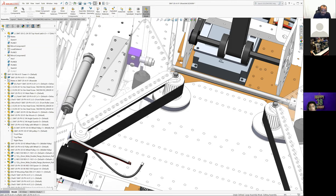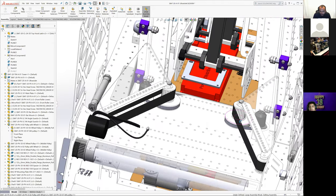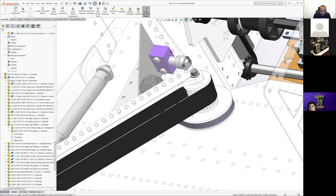Had we had a Versa Planetary, we probably would have gone a little bit more reduction. But because you have so much torque in the Neo 550s, there wasn't a situation where we were worried about jamming. And most of the time, you're not trying to use more torque to fix jams anyway, because that largely means you're shoving the ball in somewhere where you don't want it to be, and you need to be reversing to try to pull the ball out. So we were fixing any of those types of issues, and that worked well enough.